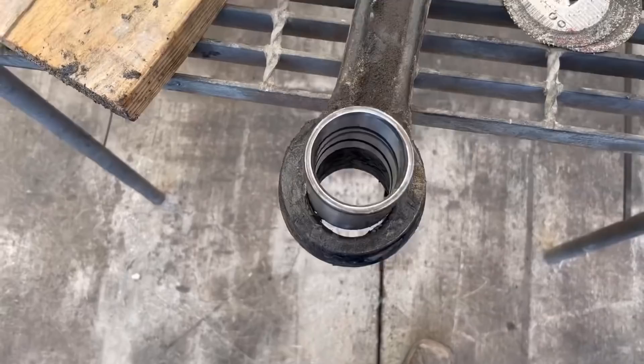Here's the problem we're running into this morning. There's a little light through there. The dog bone is cast steel — it can be welded. The customer doesn't want to spend money on a new dog bone, so he asked me to doctor it up. I'm going to try to fill those gaps between the bushing and the dog bone with a couple of passes at 7018 after I preheat, let the bushing sit in the freezer to shrink down, then tap it in. I'll probably have to do a little grinding. Wish me luck.